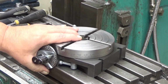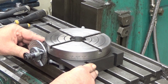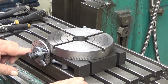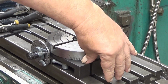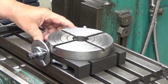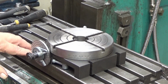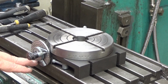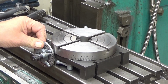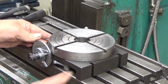That's the dividing head. It has some fancy issues, like you cannot place it too far into the table. You have to keep it level to the edge. So I need to clamp it from the corners, from one here, and one here. Maybe one here too. I have the clamps, so no trouble there at all. But while using these dividing discs, it's not very good because it just doesn't go, as you can see, on top of the table.